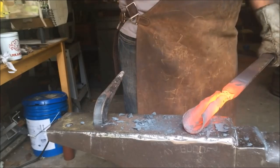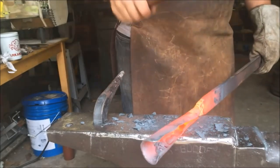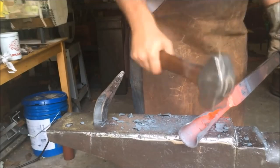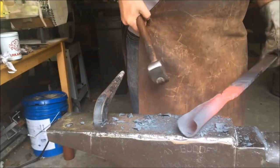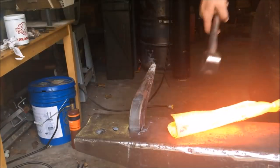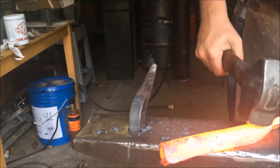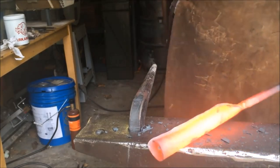Just continue rolling using the hammer and anvil — keep rotating it, finding the right angles to hit things to forge the shape of the socket. I've basically picked which part is going to be on bottom and which on top, so now I can start rolling it more tightly. You've got to make sure you have a decent amount of heat. If it's thin it loses heat quick and you don't want to be banging on it while it's black because you'll make things crack.